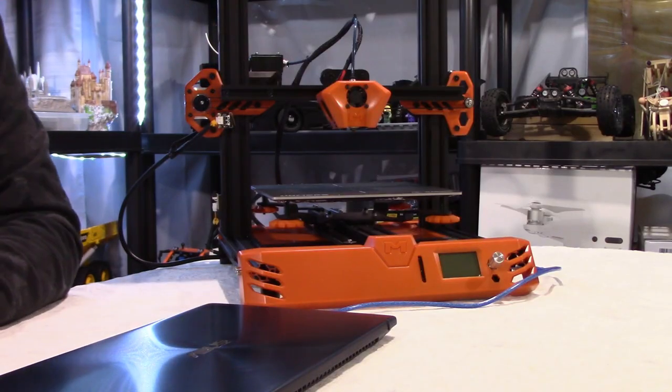So guys, if you find something, I know that many of you have a working printer because I see it in my comments, but my printer was working fine at the beginning, but when I started to do long prints, then I got print interruptions, as you know, and layer shifts. So if you do find a firmware file for this printer, let me know, and I'll just use the same process. I know how to do it now with the Arduino software to modify the file and push the firmware update to the printer.